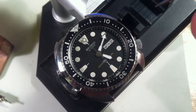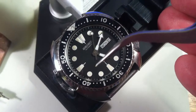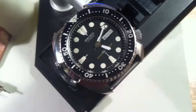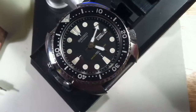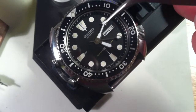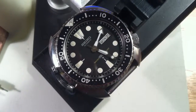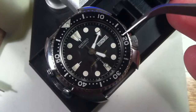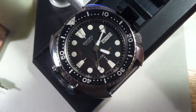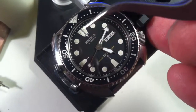Okay Mike, how are you? Here we are. It is assembled now. This is your reloomed dial. These are the reloomed hands. What I did with this, because of the age and the era that your watch was made in, I haven't seen one of these that didn't have the slightly yellow dial loom and the wider hour and minute hand loom. And that's what I replicated here because my goal is always to have a watch that looks like it hasn't been touched. I want it to function and look great, correct and original. So that's what I chose to do. And I'm pretty pleased with the results. I think it looks pretty nice.